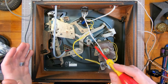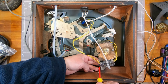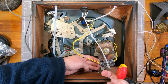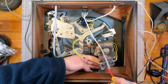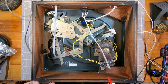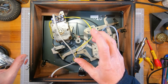Okay, so I've been doing a bit of investigation and looking around. I could see this, don't know if you can see that, there's a green wire here that's been cut off, and a bit of Googling seems there's a lug on the bottom, well it's actually the top because this is upside down, but on the other side of this mains connection point, and that is an earth lug there. So that earths the motor. So the plot thickens. Yeah, it's getting exciting.